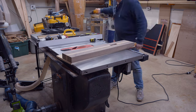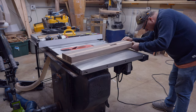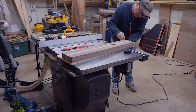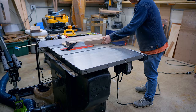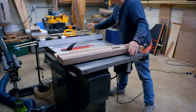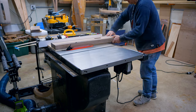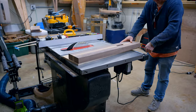The first thing I had not previously tried was using a jig to taper some table legs. This seems rather mundane in hindsight, and it's possible I've created my own jigs before, but I certainly had never used a jig to taper table legs. The jig itself is super simple, made out of scrap wood and some MDF I had laying around. I knew how wide the top and bottom of the legs needed to be, so I made the jig to remove the difference. That worked perfectly for the first cut, but when I flipped the leg over, I no longer had a square surface to reference from. Pondering this for a minute, I used the cutoff from the first cut to recreate that 90-degree edge and the perfect reference point. I made the second cut, and voila — I had my tapered legs. I repeated the process for the other legs and they were identical. Challenge one has now been surmounted.